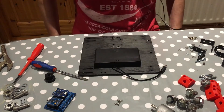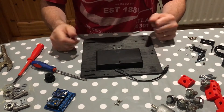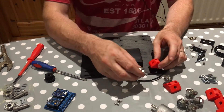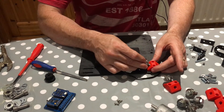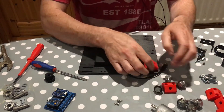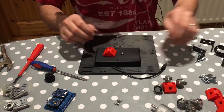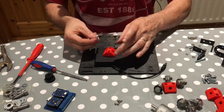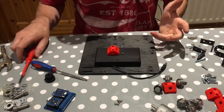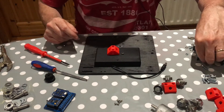Next I'll put on the bearing mounts. The way the bearings work is they go on like that. There's a captive nut placement — there's a trick to get the nuts in. It takes an M4 nut and then a bolt comes up from the bottom — a 15mm bolt. Getting them in is quite tricky, so let me show you how I do it.